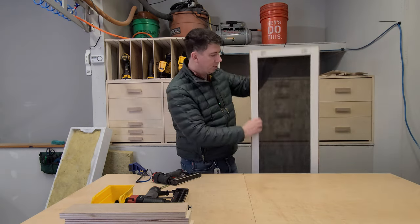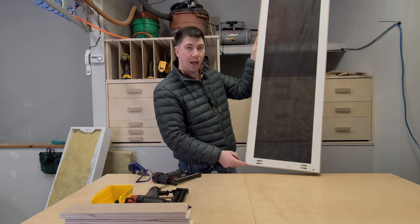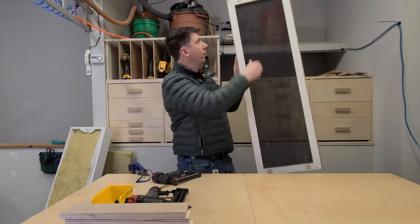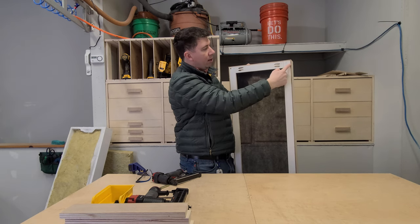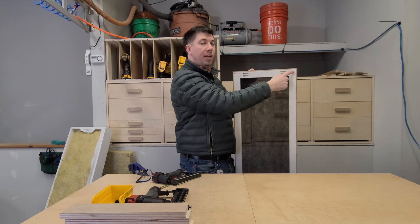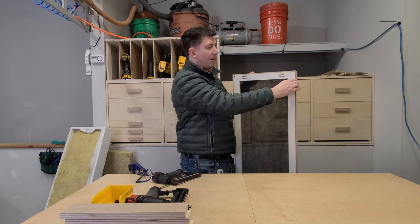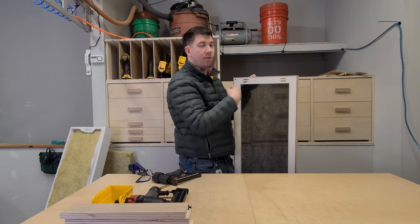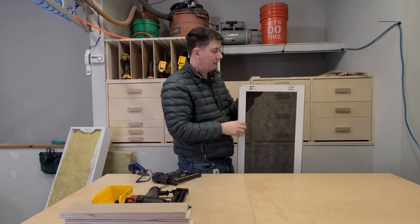The total dimensions here — before you apply the quarter-inch plywood — you're looking at about 48 inches for the rip-down 1x3. The total width is about 15 inches before you put the plywood on. You want about 15 inches total, so that fits your acoustical insulation really nicely. You can rip these down to whatever size; if you want to do 1 inch, you'll just make this 15 inches total — so 13 inches in the center.